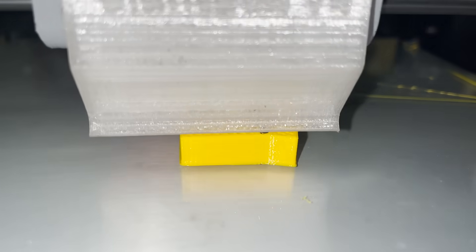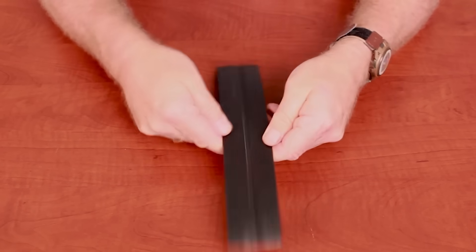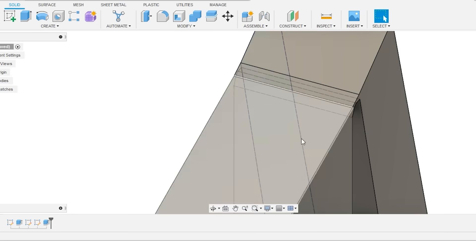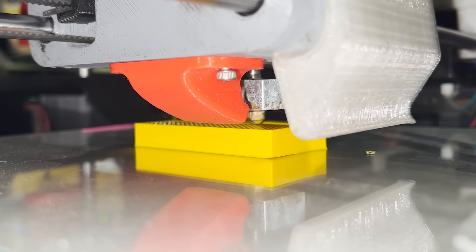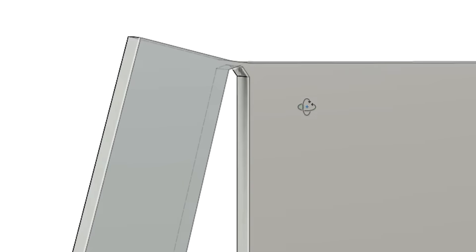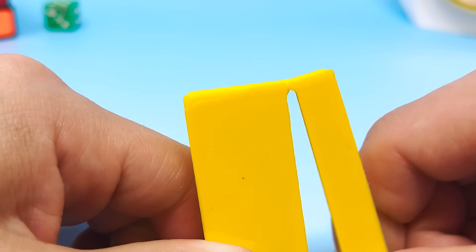While that's not an ideal situation, you can do it inside of 3D printing with certain types of materials. A typical living hinge can be done with TPU, polypropylene, or other types of materials, so it can be mass produced and create a good reliable piece. But you also have to consider the orientation of the part — it can only be printed on its side, which can limit it to some degree. Fundamentally, it's not very good engineering because it is a point of fatigue that will eventually wear out.